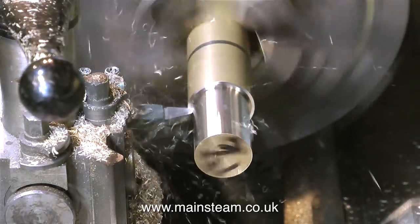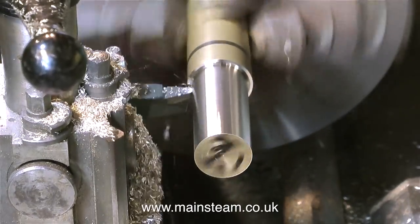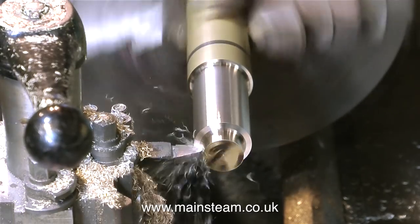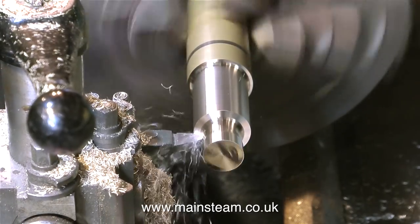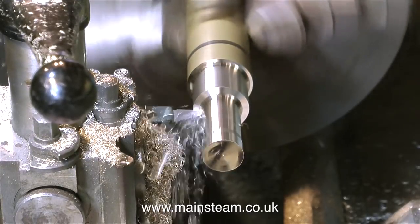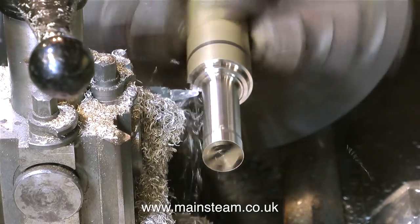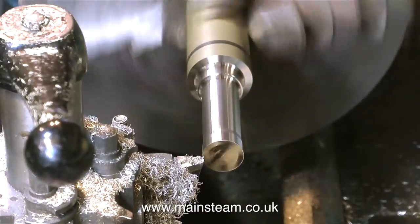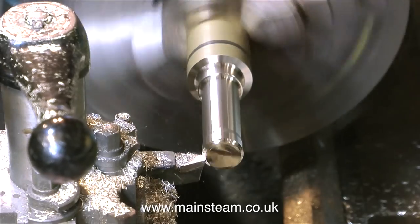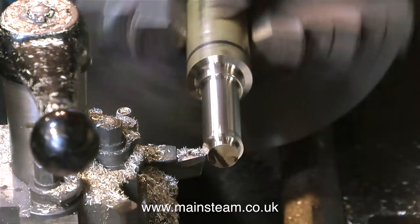What I'm doing at the moment is a bit of total freehand turning, making it up as I go along, and this is very therapeutic — no rules, just get on with it. The only measurements I'm concerned with are the length of the column — you can see the felt-tip pen mark I made on the brass to start with — and also the diameter of the end piece nearest to the camera, which I'm sizing using one of these newfangled micrometer-type things.